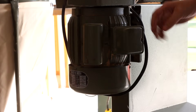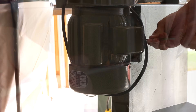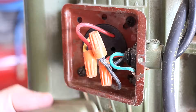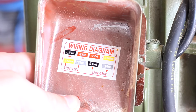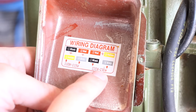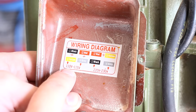After that, your plug should look something like this. Now don't plug it in just yet or else the world will explode — we need to rewire the motor first. On the motor itself you should find a small wiring box with an access plate. Go ahead and undo that and you should find a handful of wires and a diagram. Well, hopefully you find a diagram — if you don't find a diagram, we're in trouble. When looking at this diagram, we can see that it has a 220 volt configuration and a 110 volt configuration.